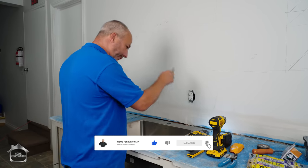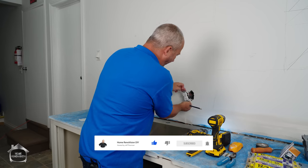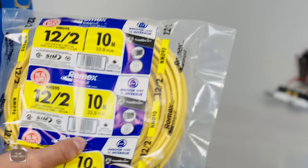Basically, what I've got to do is take these two plugs, which are on one circuit. They're wired a little uniquely — it's on a three wire, and I don't like that. Today's code, we use 12/2, and we can join as part of a series.